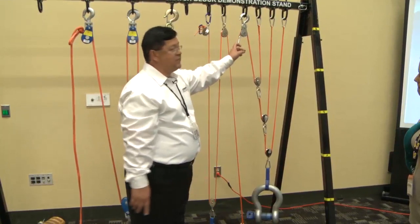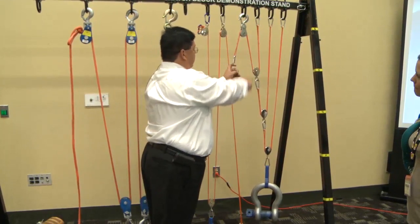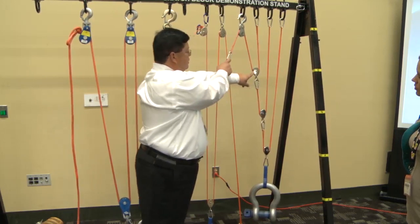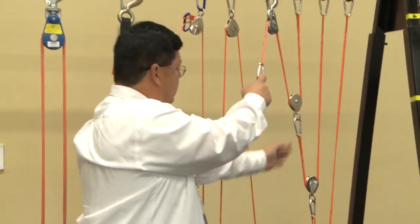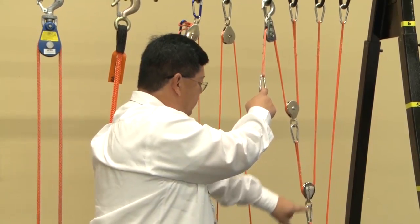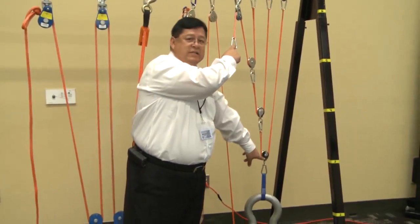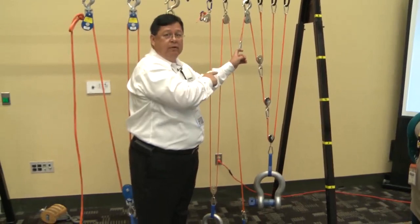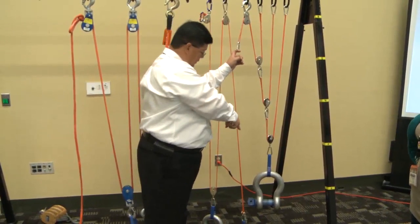Using the tension method, we'll use one T as the tension. If I have one T tension here, I have one T over here. It goes through a pulley and comes out as one T on the other side. The two T's together produce two T at this point. There are now two T on this line — going through here, two T on this side doubles the effort to make it four T. Then four T here and four T here gives you eight T, so the mechanical advantage in this system is eight to one. I only have to pull one eighth of the amount of weight to get the load to move, but I have to pull it eight times as far to move it the same distance.